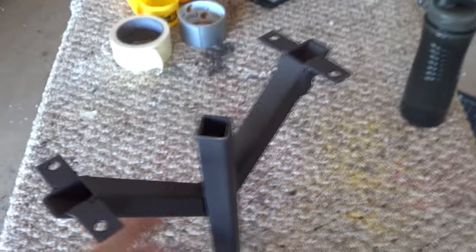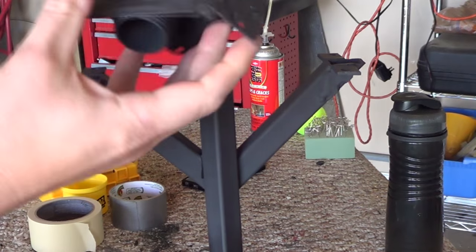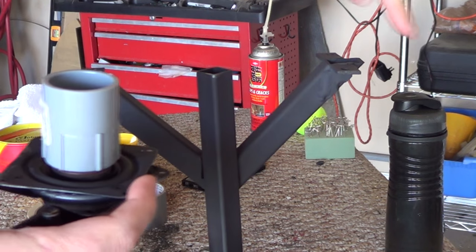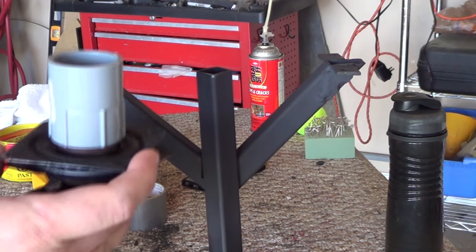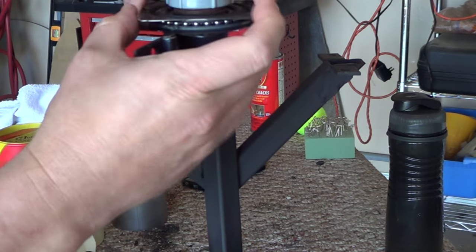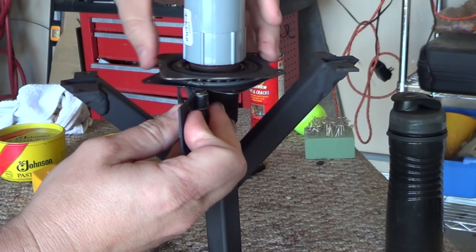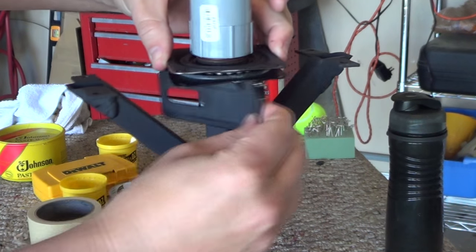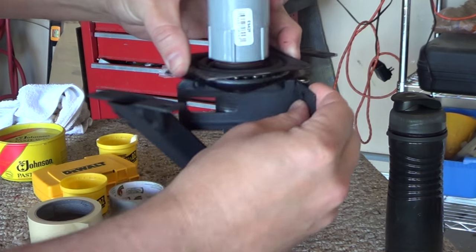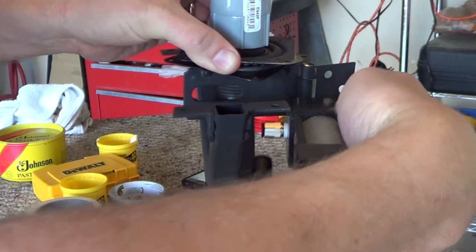For the head, it's the exact same scenario. On the shoulders it's the exact same setup - a bearing and a pivot point. There will be a board mounted on top for where the shoulders are actually going to be mounted. The top of the Lazy Susan spinner will be attached to that board, so this will slip down right over top. This will be stationary, and I'll have another air cylinder up here working the head, turning it 90 degrees.